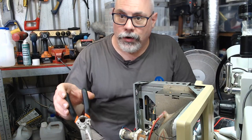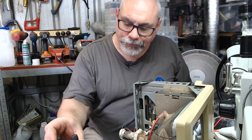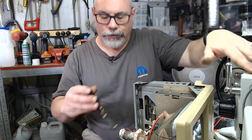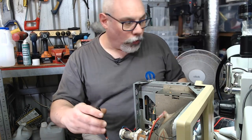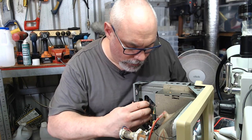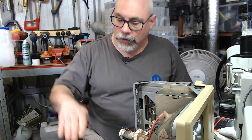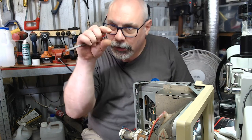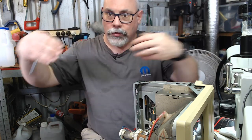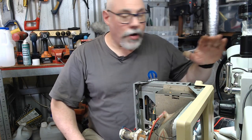There are cheaper alternatives. This one is quite expensive because of the whole big rig that is here. There are ones that have a smaller mount, so they're not quite as pricey. The most important thing is that there is clearance underneath. A standard microscope is designed to be that far away from whatever you're looking at. With a microscope like this, it's much higher, so you've got room for your hands to work underneath. But they are really, really important.